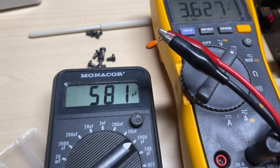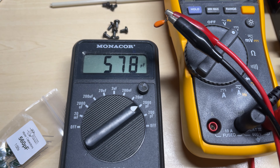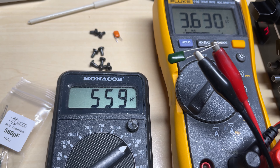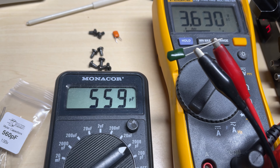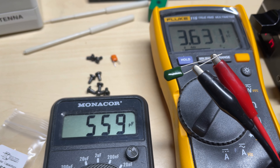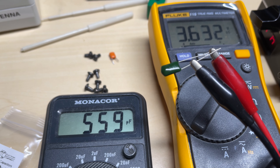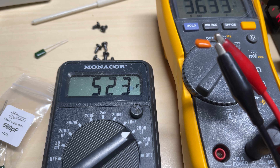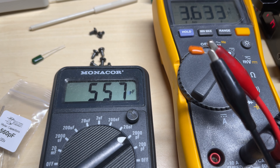So I decided to put the capacitor on my capacitor tester — it's not an ESR tester, just a capacitance tester. The old one seems to be all over the place. With a replacement new capacitor, as you can see it's pretty much bang on and absolutely rock steady. So the new capacitor is rock steady and the old one's all over the place. We connected the old one back up and it's just not consistent.